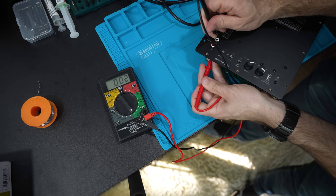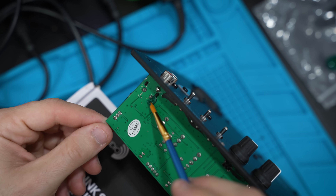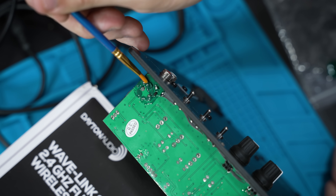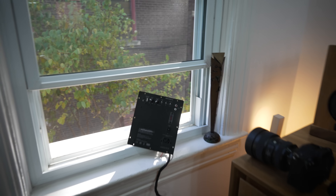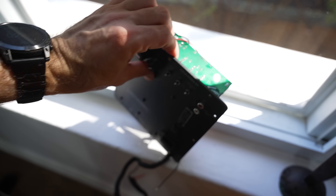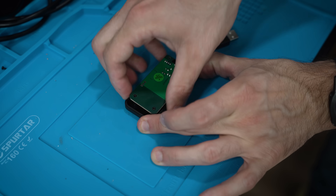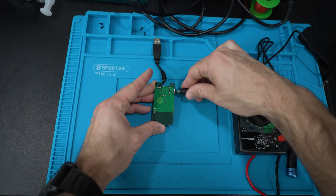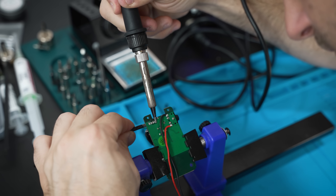But I also had a bit of a problem — removing that black gunk did some damage to the PCB, and I was worried that over time that might allow for corrosion and potentially interference. So to fix that, I painted on a thick coating of an insulating solder mask. The only spots I left bare were the contacts where I'll make my audio input connections. This is actually a UV-reactive coating, so I set it in the window to soak up some rays. Next, it was surgery time for our wireless receiver — more or less the same process. I stripped it down to its bare PCB, did a bunch of diagnostic work to figure out which pins are responsible for power and which ones for audio signal, soldered in some extension wires, and stripped off any parts I wasn't going to need anymore.